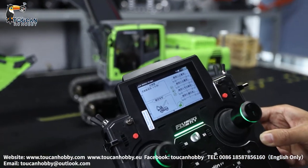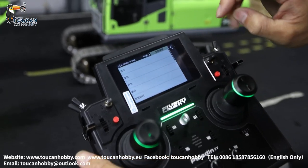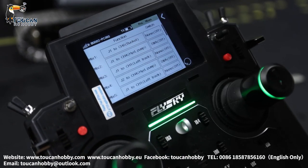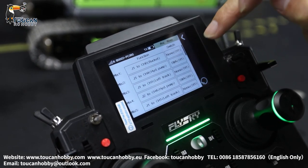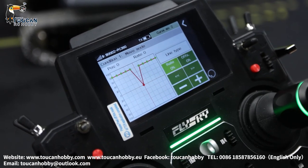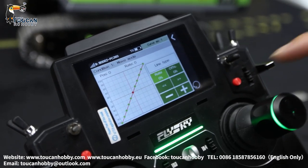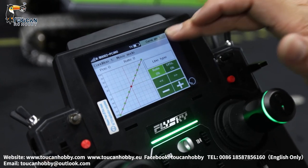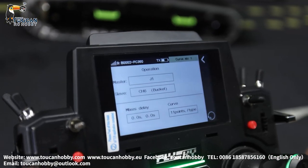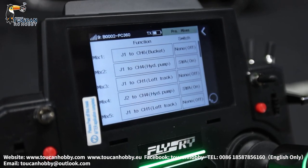So let's stop and see what the control curve looks like. Sorry, I forgot to change to English. Go to settings, change to English, and see the pro-mix — you will see the control curve. So J1, hydraulic pump, it is off. Now you see the control curve. This one is for the pump start, it is V-type. And we will see another control curve — the bucket — the valve open for the bucket. This control curve is only a straight line, so not easy. For the big arm, you see it is only set up for the distribution valve — now this is only the bucket control curve. But for the front arm and the big arm, there is no control curve to open the valve slowly.